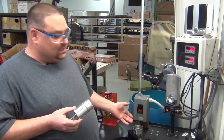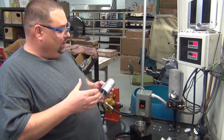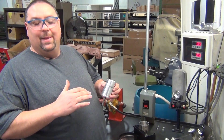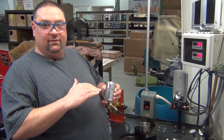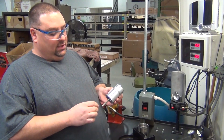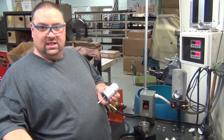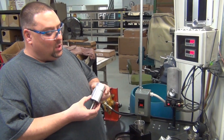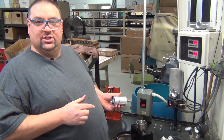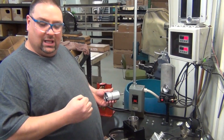I'm using a test stand here. We will determine the slip and the pressure. When we place this in here, the slip is basically the amount of oil passing underneath the drive gear. If too much oil passes underneath the drive gear, that will not allow the drive gear to spin and turn this shaft, which will turn the eccentric on the tip. When we test the motor it runs in a counterclockwise position, but when we do the slip test we will reverse it, running in a clockwise position.